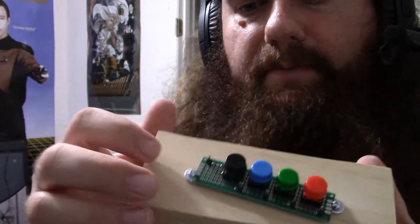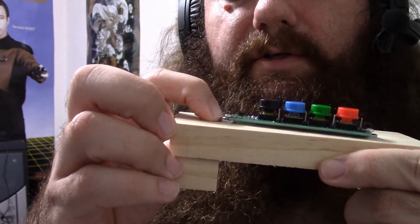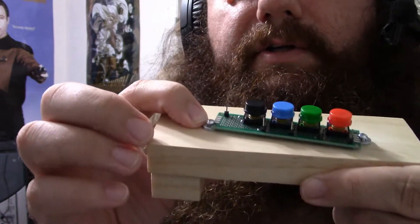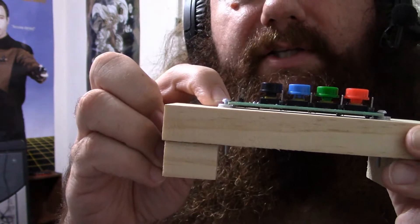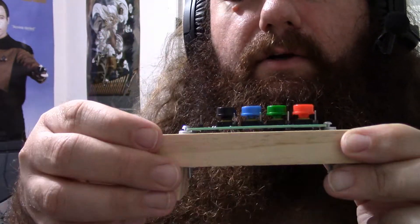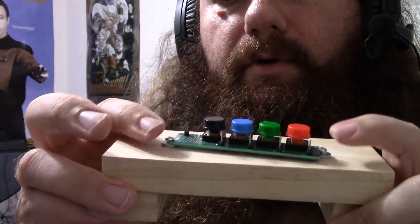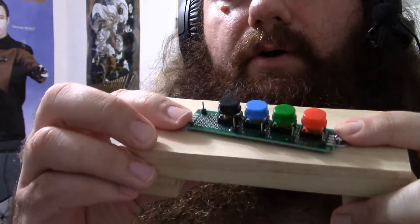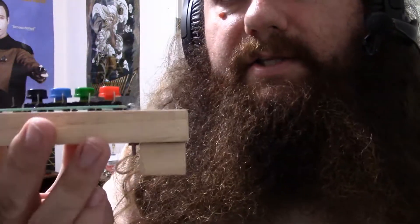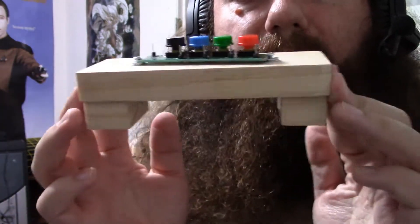I have little washers — another cheap plastic bag at the hardware store, about a dollar. I use washers under the board, and the screw grabs on top. The washers act as risers, lifting the board up about a sixteenth of an inch — a few millimeters — so the board isn't being bent. Because under here you have solder dots where the leads are, so the board doesn't sit flush on the wood. So the board is pinched between the washers and the screw down to the nut. Not counting the electronics, just the mounting minus the cost of the tool, this is probably about 80 cents.